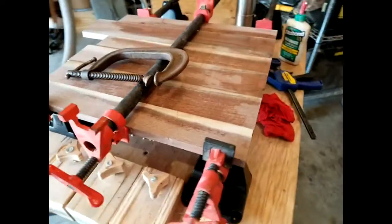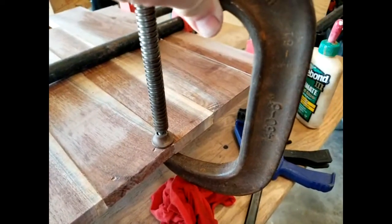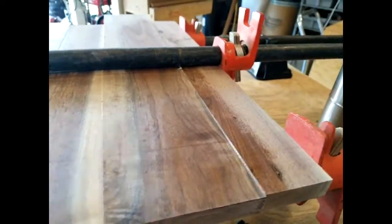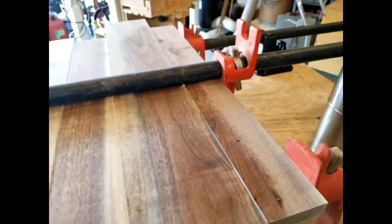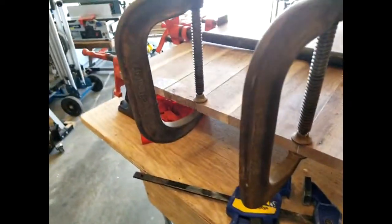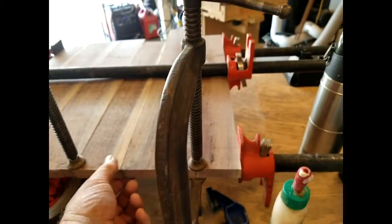The planer does a pretty good job, and when gluing, if I get any edges that aren't quite lined up I'll loosen the clamp until they come up square and parallel. It gets pretty clean — you'll barely need to sand. This one here has a slight edge that's not very much and that'll sand off, or it'll get cut off by the CNC. When I had this one lined up and moved the clamp over, it popped back by about a 64th of an inch, so I used two clamps to hold it and applied pressure to keep it — then I can take the clamps off and we're ready.